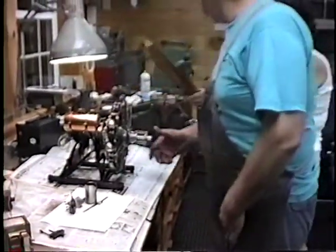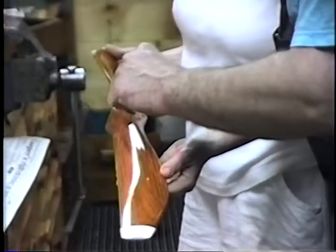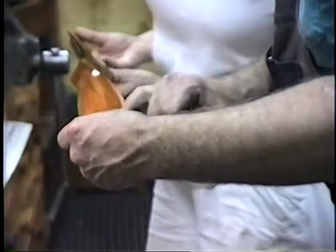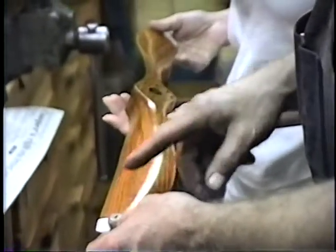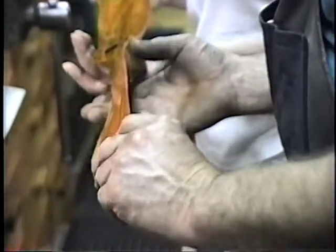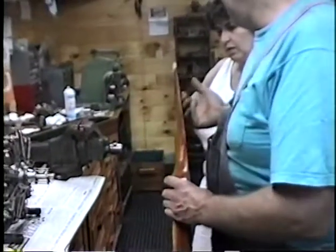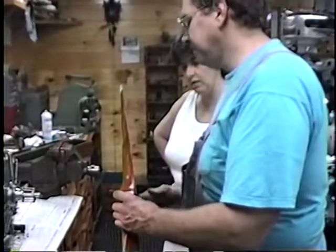What kind of wood do you use to carve it? Poplar. It's lightweight and easy to carve. It's six pieces of quarter-inch poplar all glued together with epoxy-type glue — you can see where it's been glued. Had to make templates to carve it every two inches; there was a template that bolts to a known surface and you work from that. There's a set of templates for each side. The propeller has an airfoil to it — see the curve? As it rotates, it's creating a low-pressure area which pulls this way. Atmospheric pressure pushes here because you've lowered the pressure by creating an airfoil, just like a wing on an airplane. It's a spinning wing.